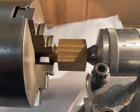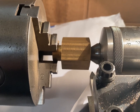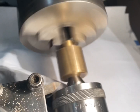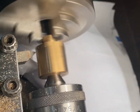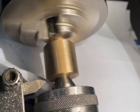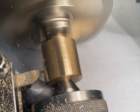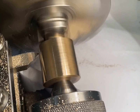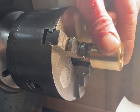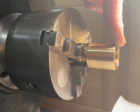This piece of stock that I've got mounted in the machine — I'm going to make the oil tank out of it. I'm going to turn the outside diameter down to 26 millimeters. I've turned down the outside diameter to the correct size. It's time to bore the inside diameter out to the correct size, 24 millimeters.